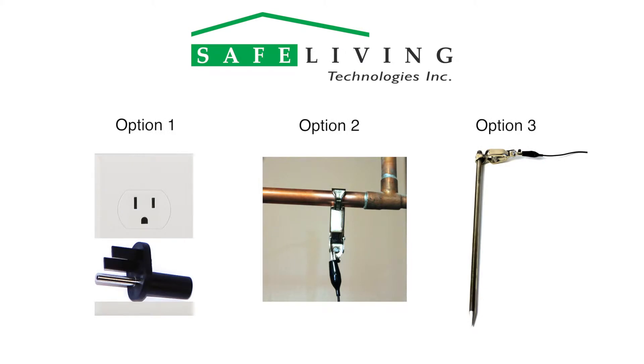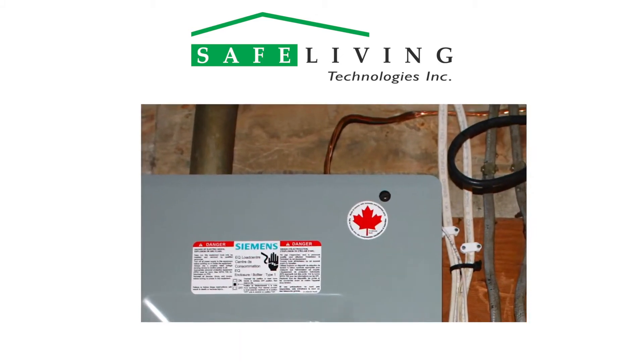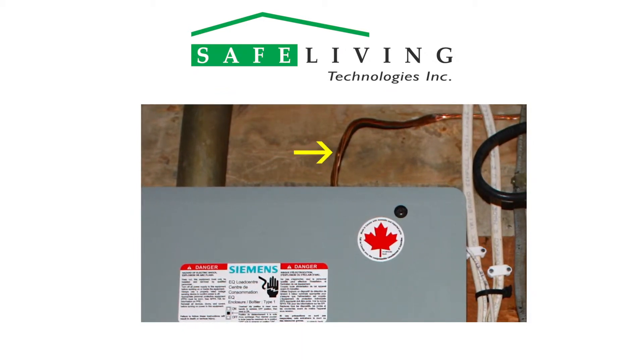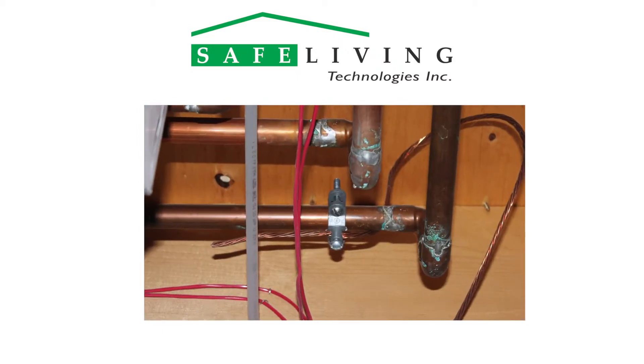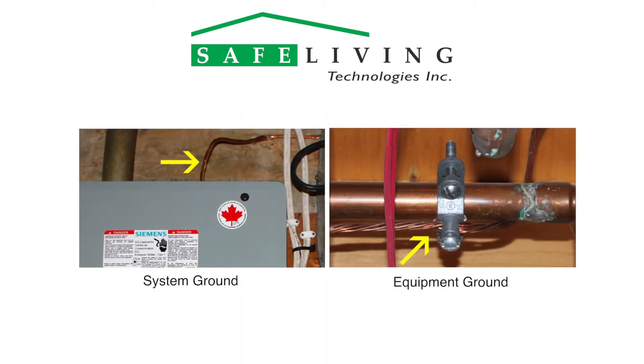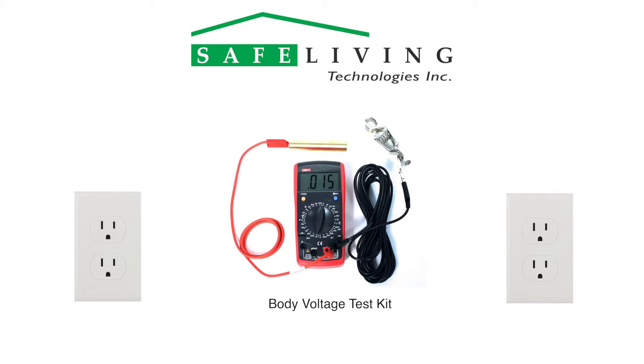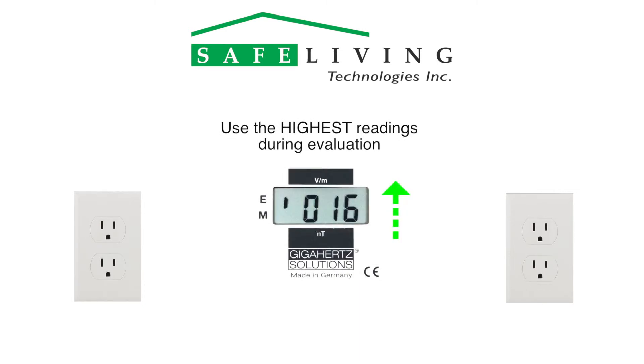All three methods may be used as a ground connection for your meter. However, it is important to know that voltage potential differences may exist between these points, which can be caused by many different variables. Shown here is a typical electrical panel in a house — it is grounded in two places. The system ground connects to eight-foot grounding rods located in the soil outside of your house, and the equipment ground is connected to the water pipe. Because of a potential voltage difference between these points, readings referenced to ground can vary depending on your ground connection point and the location of the AC outlet used. This is especially important at lower measurement ranges and body voltage measurements. In any case, only the highest readings should be used when evaluating your results.